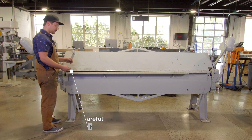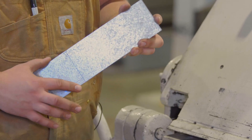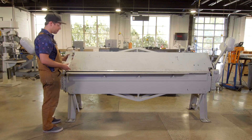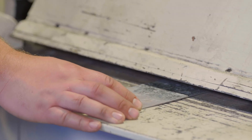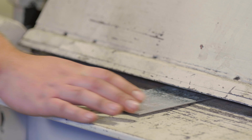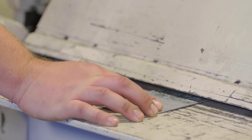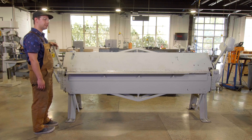So I'll show you how to do that. We'll come in and we'll clearly mark our line where we want to bend on our metal. We'll slide it in there and we'll line that mark up right where the clamp is going to come down. We'll lower our clamp as we line it up, and then we'll fully clamp it down so that it's nice and secure.